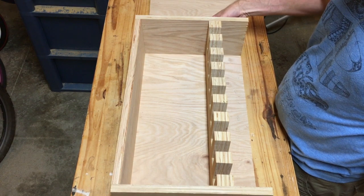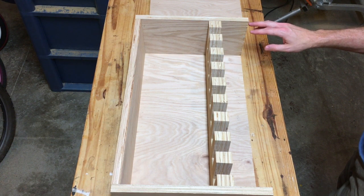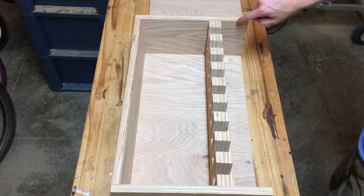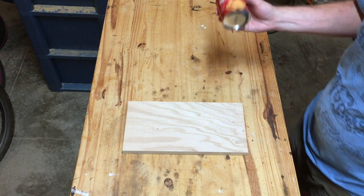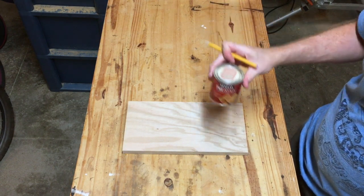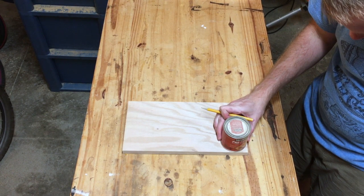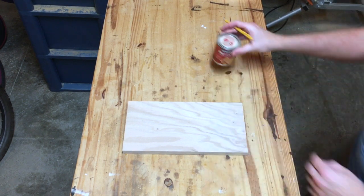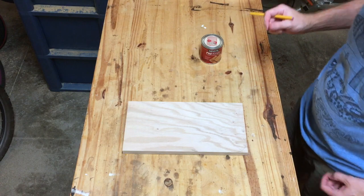The top's cut and fitting in nicely. The last thing to do before we screw this up is take care of the edge at the bottom. Since you'll be putting clamps in here on the side, it's a pretty sharp edge, and to make it a little easier and less painful on the hands — and to look a little bit better — I'm going to cut a little round corner in here. I like to use any small can I have in the shop; I'll just lay it on the corner, trace it off with a pencil, then take a jigsaw and round that over. Once I have this one cut, I'll use it to mark off the next one so they end up with similar edges.